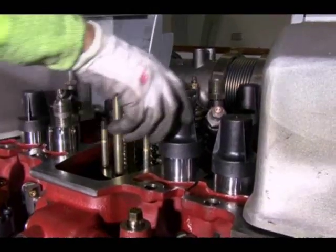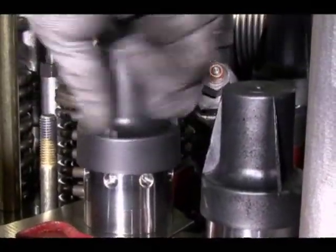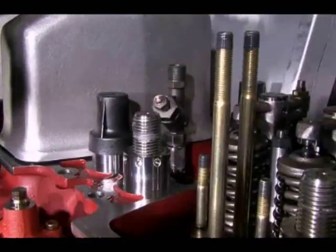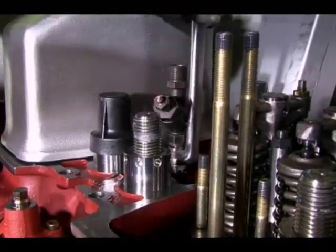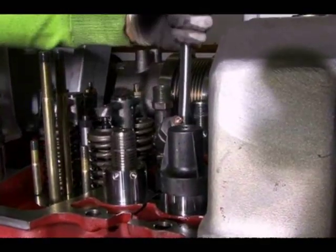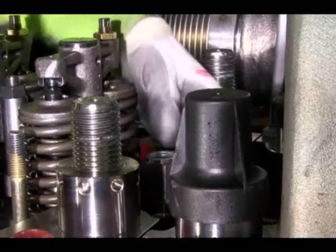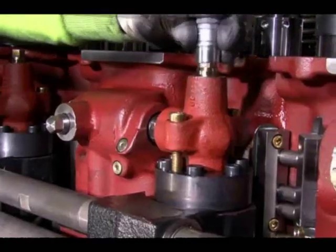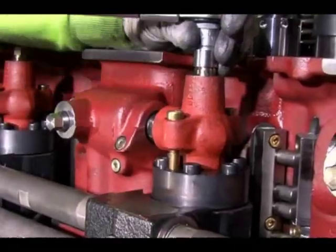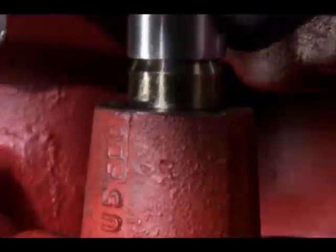The protective caps are taken off the cylinder head studs. The left-hand indicator valve is loosened and turned to the left of the cylinder head. The valve of the adjacent cylinder head is loosened and taken out completely. On the injection pump, there is a fuel injector delivery pipe; the thrust screw of this pipe is loosened and removed.